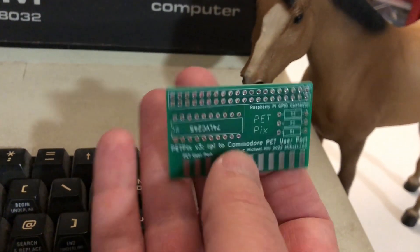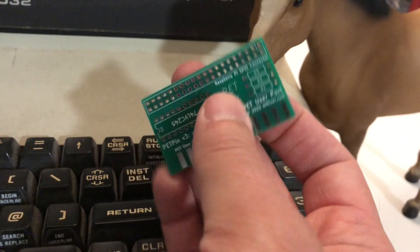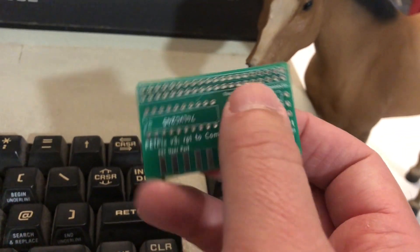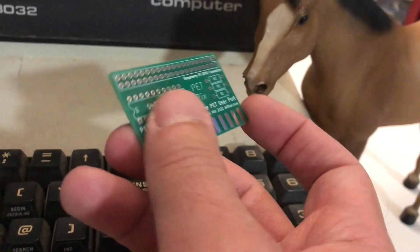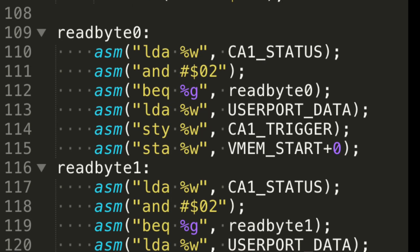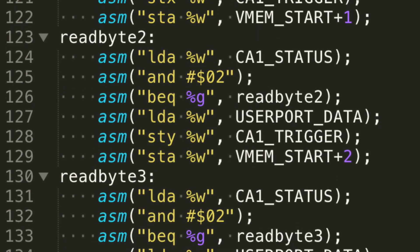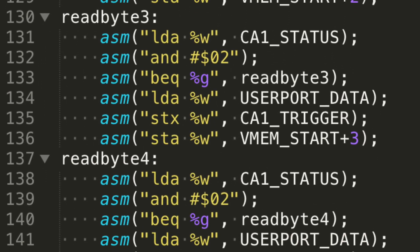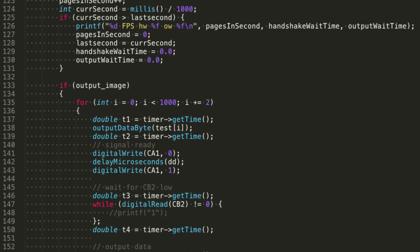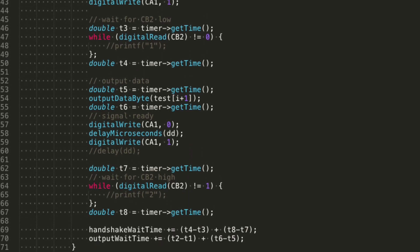Fortunately, right in time for the video, a PCB for the PetPix arrived — the connection between the Raspberry Pi and the PET. I'll make this board available on my website along with the KiCad project files — the project files are available in the repository linked in the description and you can make your own if you like. On the software side we have something that runs on the PET itself and something that runs on the Raspberry Pi. The PET program is basically reading as quickly as possible from the user port and then writing the bytes into video memory in a big unrolled loop for speed. On the Raspberry Pi we have one program which converts images to PETSCII characters and another which reads frames from a file or a network socket and writes to the Commodore user port. This is all on the GitHub repository if you want to take a look or try it yourself.